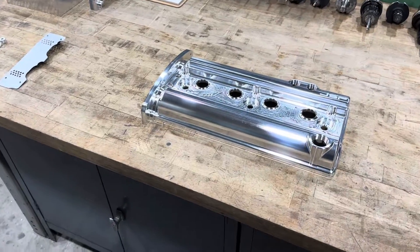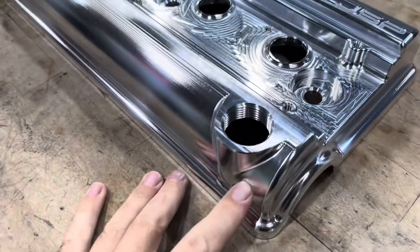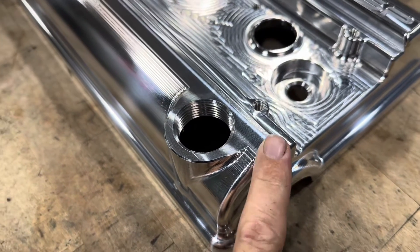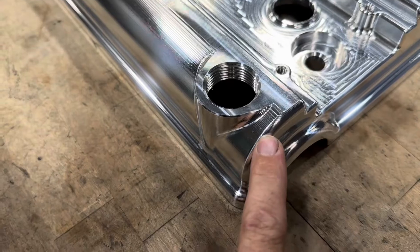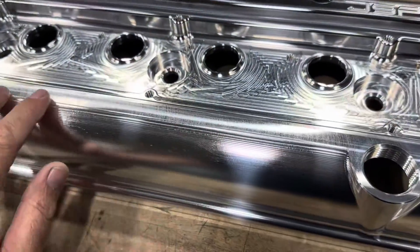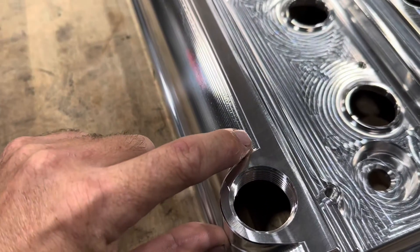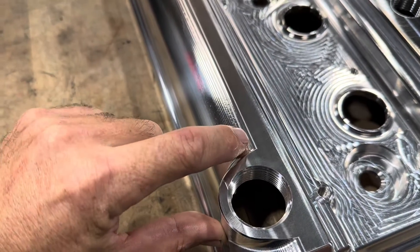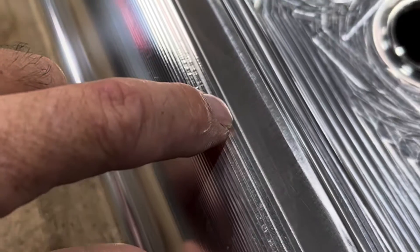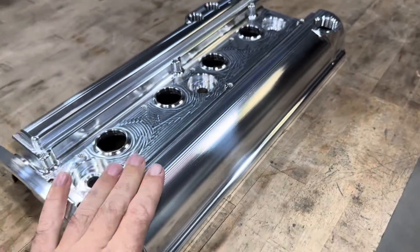Let's look at the small details on the valve cover — even the stuff I mentioned during programming, like the step-down on the side. Looking closer at the waterline step-down, towards the top of the valve cover the step-over is further, but as it goes further down the side the step is less noticeable. I'm not going to change much, but one thing I did notice is that the very first step is pretty far over on the top, so I'll probably start that tool path at the depth of that first step to remove that one line along the top.